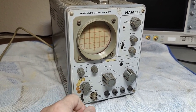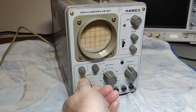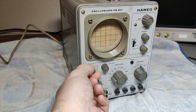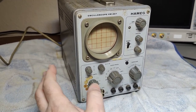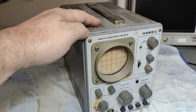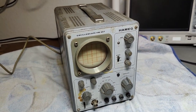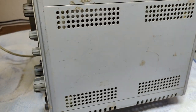That is always what I recommend to do with old vintage equipment. First I did a little inspection on all the knobs, and everything seems to be moving with exactly the right kind of feel — except for this one, which I can't move at all. There's definitely something broken. When it comes to really old vintage stuff that looks rusty, please open it first, do a deep visual inspection, and then carefully power it up, because you can create much more damage if it's already a little bit broken.